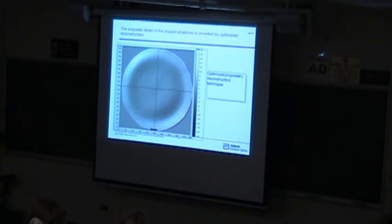This is a little variation in the boron doping in the silicon wafer itself that has led to a little bit of differential hardening of the surface. So when they polished it, it actually sort of pushed those harder regions down into the material a little bit, and then after the tool pass, they sort of spring back up. And so you end up with the height of these variations being a few nanometers, 2 to 3.